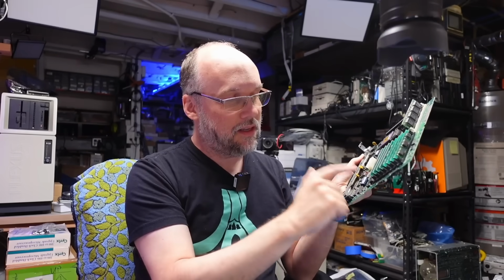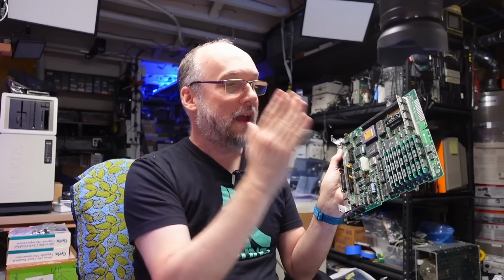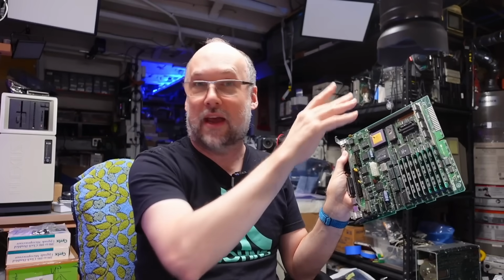Now this particular board here, this is the one that got the 12 volts. If you remember when I turned this one on, it didn't have those bar patterns. It actually had more like a gray checkerboard pattern, but with a distinct pattern of its own. And that's because this uses NEC branded chips. It seems that there are 2 companies that make chips in use on these motherboards, the TI ones that draw the horizontal bars, and these NEC chips that give you that gray pattern.